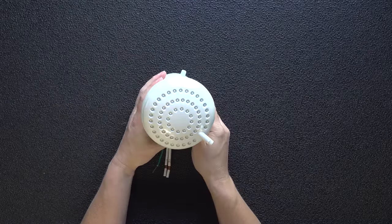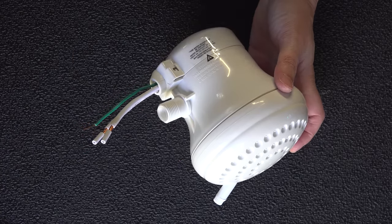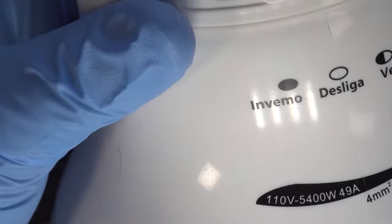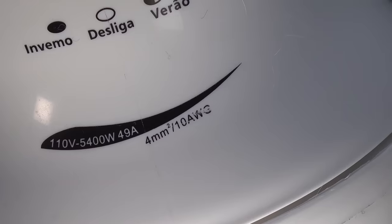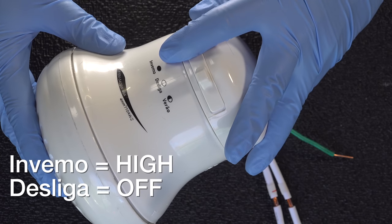The simple device is ingenious — it can deliver a hot shower and you only use it when you need it. These sell for as low as $20, pretty close to what we might pay for a shower head alone, but that certainly doesn't include an electric heating element inside. The one I'm holding here states it'll work on 120 volts at 5,000 watts of power. As we look at the outside, the first thing you'll notice is this switch with three positions: high, off, and low.